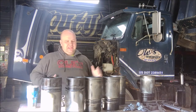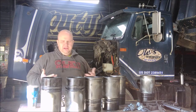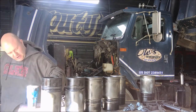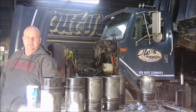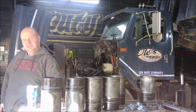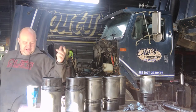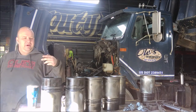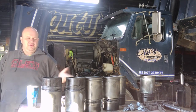Here we have a beautiful selection of liners. As we took them out, we're doing some inspecting, looking at what's going on. This particular engine — these liners use O-rings, which isn't uncommon. But what differs from this and other big cams, apparently there's a year split. Instead of using some sort of sealant to seal the top of the liners, they use what's called a sealing ring. Our research shows that some do, some don't — this particular engine did.